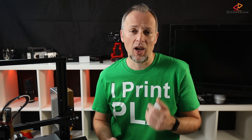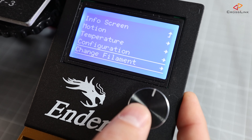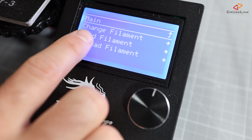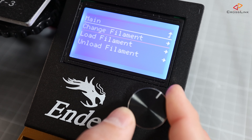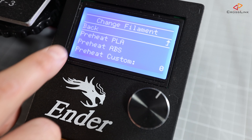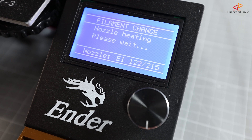Let's now test if the filament change option works as expected. Right here in the top level menu, there is a new entry called change filament, and in there we have three options: change, load, and unload filament. Pretty obvious what every option will do — I'm going for the change filament option. Then I have to select which type of filament I'd like to preheat the nozzle for. I select PLA because that's what I have in the printer right now, and it's also what I want to load.